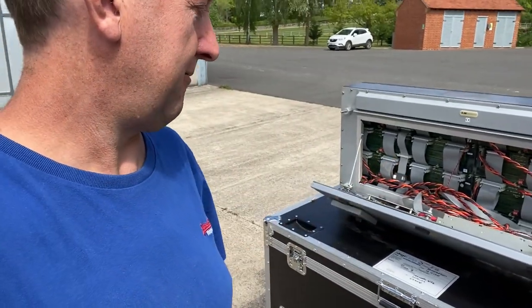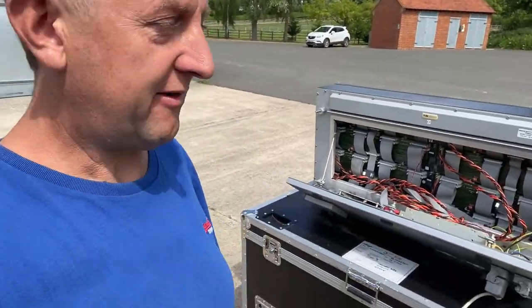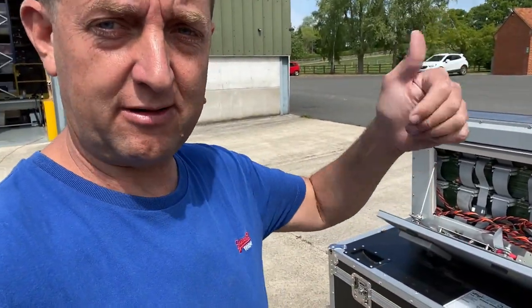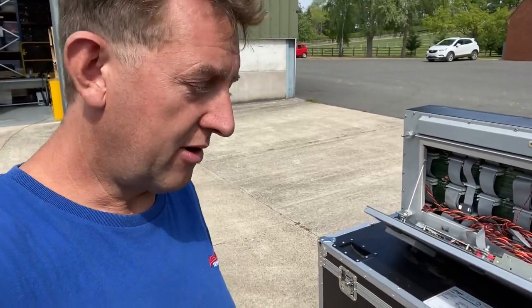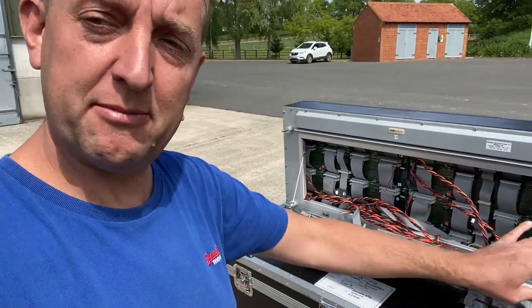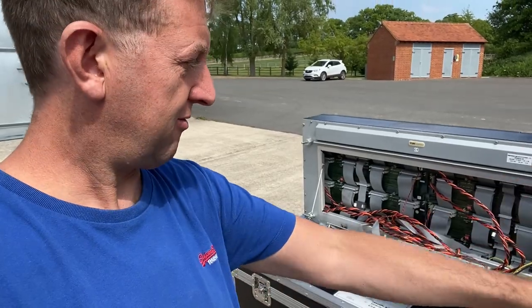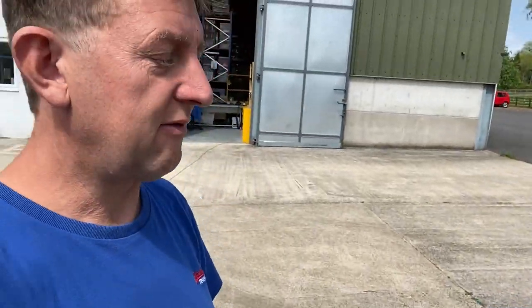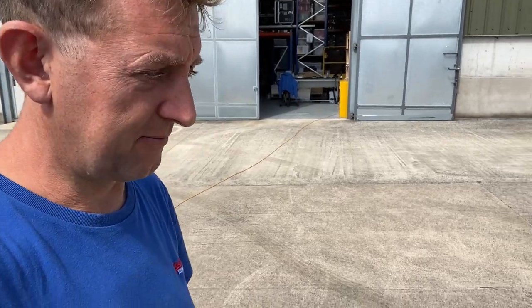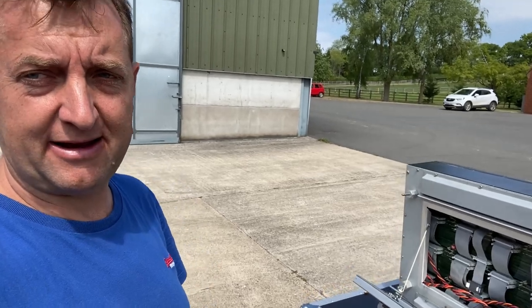If you had, for example, a 50 panel screen connected up, you could actually switch the power on with just regular breakers, just chunk, chunk, chunk. And those breakers would not trip because panel number one would have to start up before panel number two got switched on. And panel number two would then activate panel three, then panel four, then panel five. So it was a rippled startup to the AC power, which avoided any horrible inrushes. Other great little design features for this product that are somewhat absent from today's.